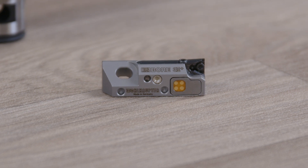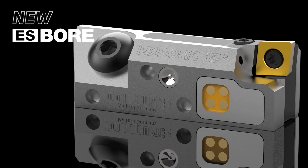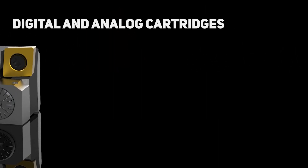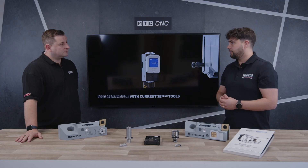Let's start with the cartridges first — so what is a cartridge boring bar and how can that help a customer? The cartridges are basically for special tools, special solutions. If you want a step boring bar, for example, to reduce your cost of production — because you can manufacture more diameters with just one tool — you can put in the cartridges and adjust them to your fine boring diameter.